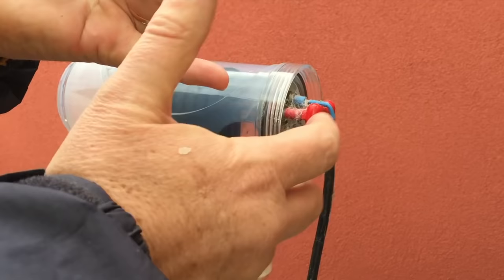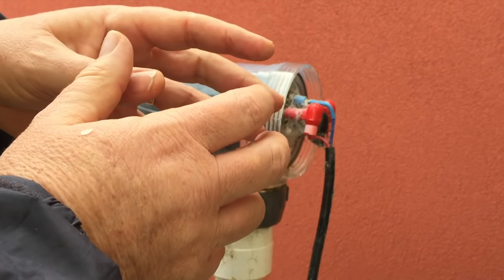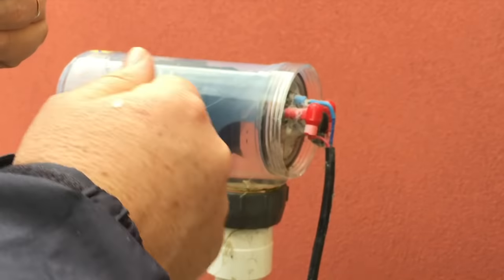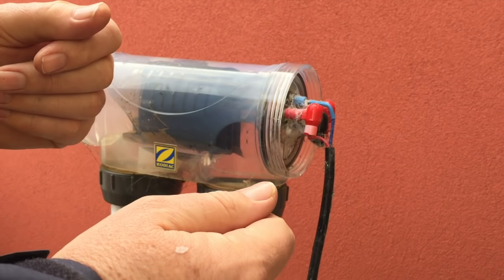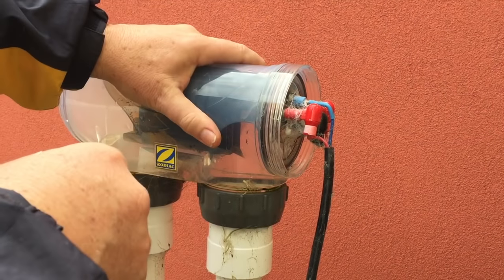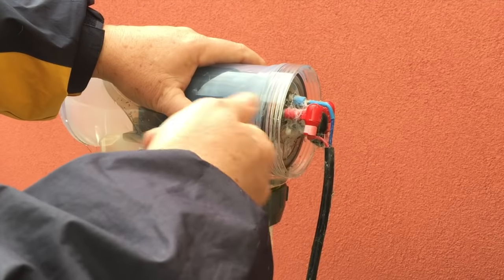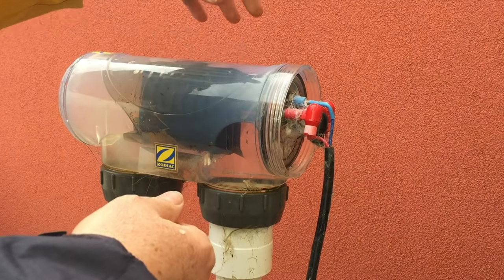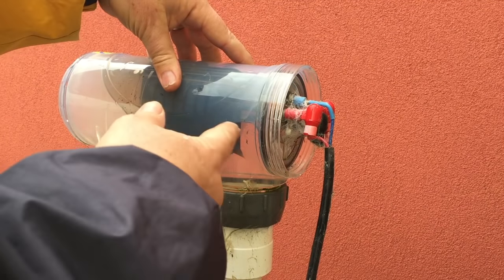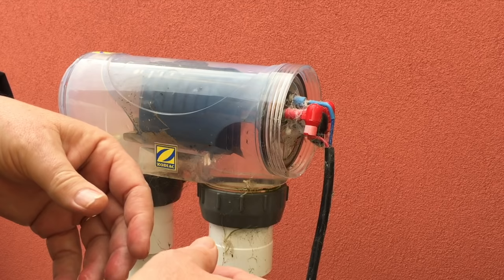The plates actually have some platinum on them and they produce hydrogen gas and chlorine gas. Never scrape the plates with anything metallic because that will damage the surface — you've paid big money for the cell. Use something wooden, like a wooden spatula or wooden ruler if you need to scrape. But honestly, just soak it and give it a bit of a tap and hopefully the calcium will come off.